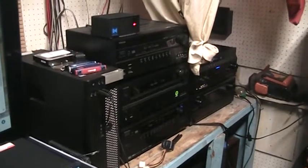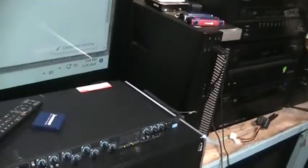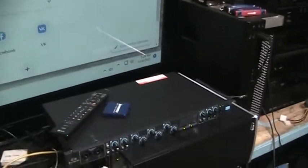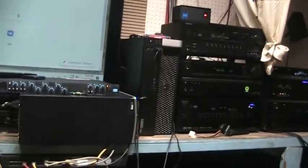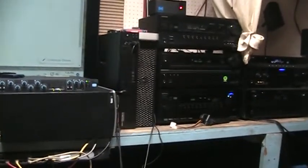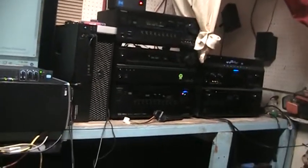I've got my cards tied together from their clocks — this one is tied on the FireWire bus in timing to the other cards, and all their timing is pretty much controlled by DTS. You can light up seven channels through DTS; DTS on optical will carry eight channels by down-converting to the lossy format and putting the extra packets in there — it's about 200 lines of code. Pretty easy and very handy.